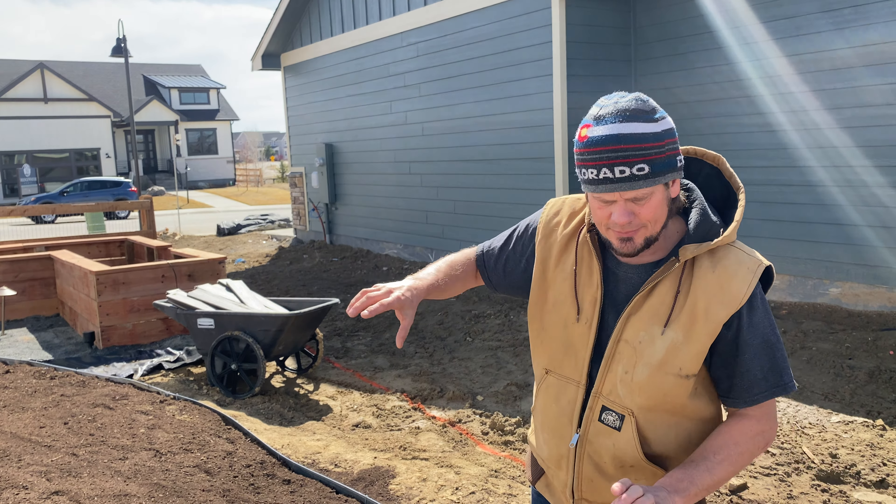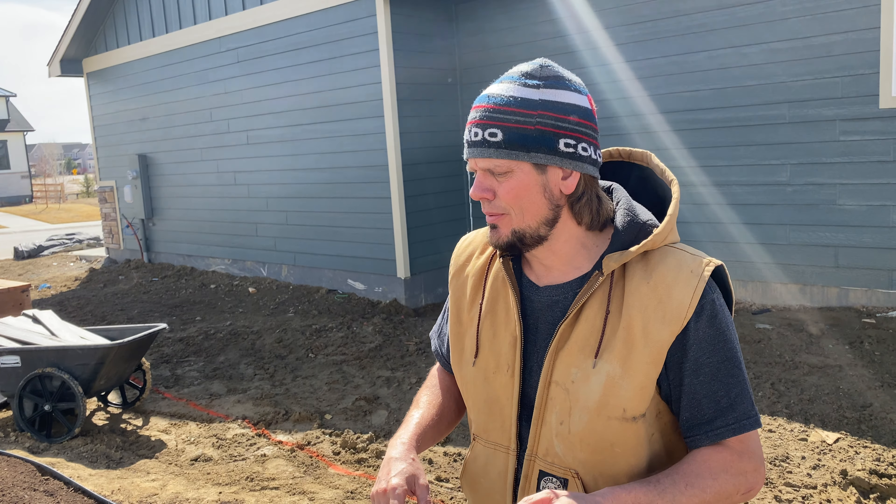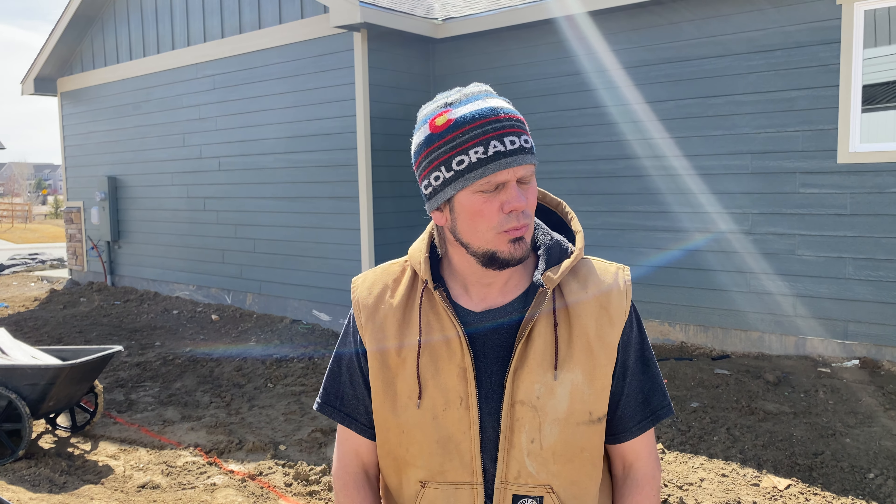The rest of this I want to say was about seventy-seven hundred dollars. That's gonna include a ton of irrigation tubing that drained off of the gutters — I'll show you when it drained out under the cement. We literally opened all of this up 30 inches deep. We had irrigation tube, squeegee, sprinkler system, electrical for the hot tub at 240 volt in one-inch PVC, and then 110-volt lighting and power plugs, and some low-voltage lights.